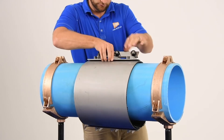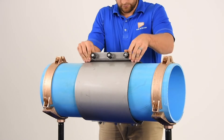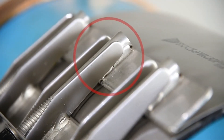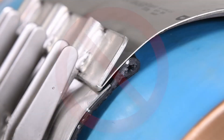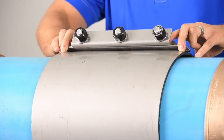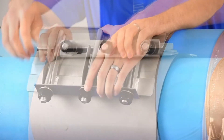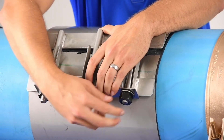Bring the lifter bar and the receiver end together at a convenient position on top of the pipe. Confirm that the finger lugs are on the outside of the clamp and resting against the side bar. Be sure the gasket and armors are lying flat against the pipe. Now slide the lifter bar along the edge of the finger lugs and hook the lifter bar in place behind the side bar. Hand tighten all the nuts around the pipe, keeping the space between the sections even.